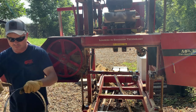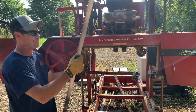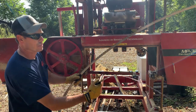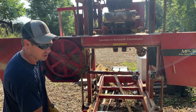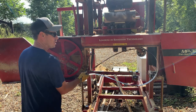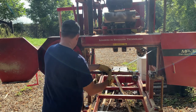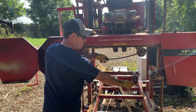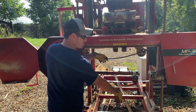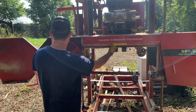You would start out with a blade that's rolled up. Get your new blade — remember to wear gloves when you're dealing with these things, they are razor sharp, and you'll regret it if you don't. You can just slide the blade back in there. Make sure you get underneath your roller guides, because these grease fittings and the shaft tend to stick out and a lot of times the blade will be laying on top of it and it'll mess you up.